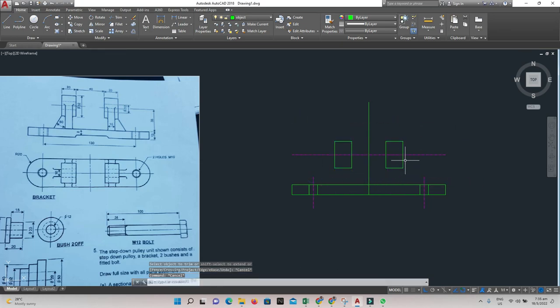And these two lines here, these little rectangles, represent here. Now, at this point, you can start drawing these little mounting parts here. That's these parts here. Now it's saying that the thickness is 10. All right, I'm going to assume that that is in the center of my object. So what I'm going to do, I'm going to draw a line from the center here down like this, and then I'm going to offset 5 on either side to get the thickness, which is there. So 5 on either side will equal 10.